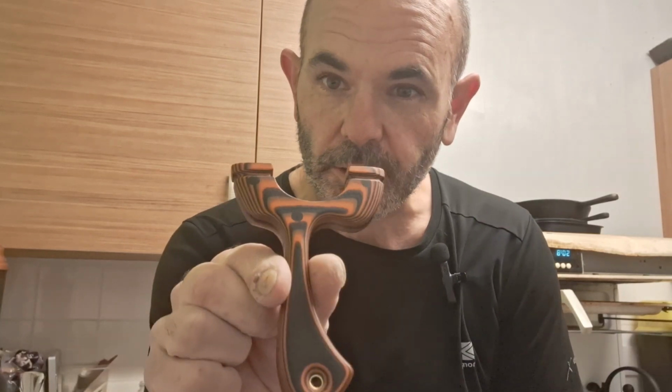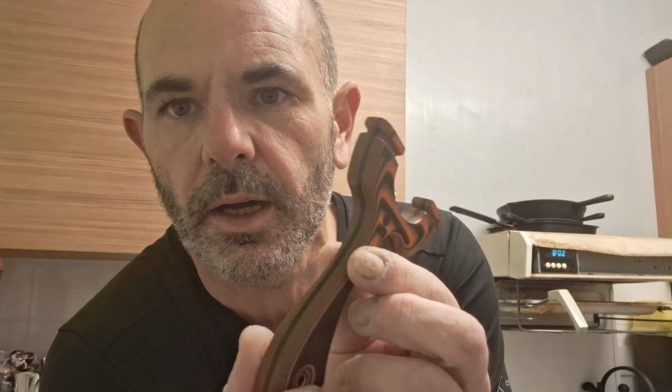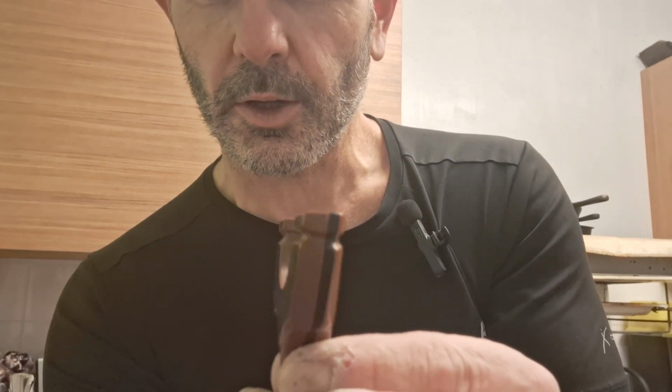Right, guys, I'm back. If you've watched this right through, thank you. I finished. I went in there at the end, like I said, with a load of 800 on that needle file. Before bringing it back in, I just took it out quick and put it on the polisher out the back. But that's it. It's ready to shoot. So pretty much we went from nothing to putting in the cuts, going through it with the ruler, with the sandpaper on to open that up. Then we went in with a round needle file and the half moon needle file just to finish off opening them up. And then at the end, the sandpaper on the needle files.